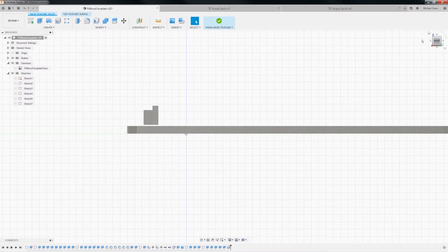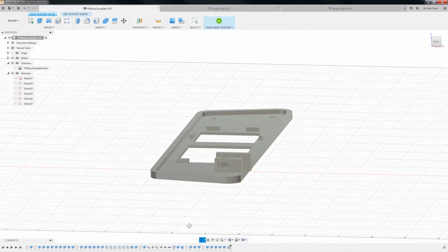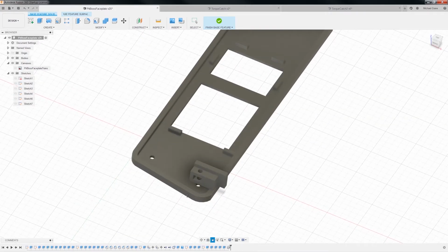So we can take a look at what's going on, right? Oh, sorry, I moved my mic out of the way. I hope you guys could hear me. And what I wanted to look at here is, when this guy swings down, so when you're tightening him, he's going to torque this way, and when you're loosening him, he's going to torque back this way, right? And so we need to put a stop right here, okay? So when he torques back this way, he just stops, he hits the stop right here.